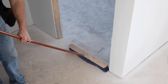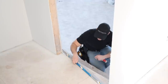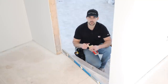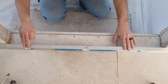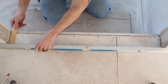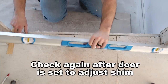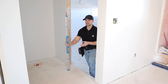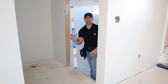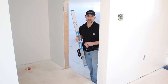Make sure the floor is clean where the door will be setting before you set it in the opening. First, check how level the floor is. This side looks about an eighth of an inch too low, so we'll use a shim. Put your level on the floor and slide a shim under it until the bubble is in the very center. That shim will do the trick. Also check the sides of the opening to make sure they're plumb — both sides look really good, so all we had to do is shim one side up a little.